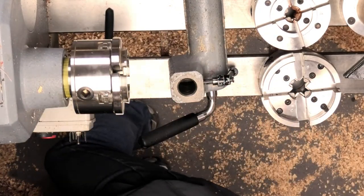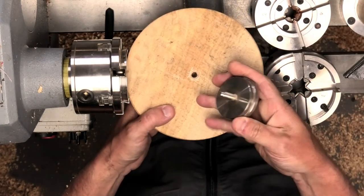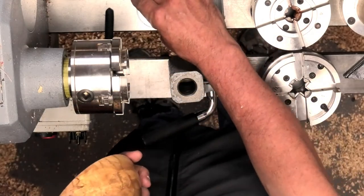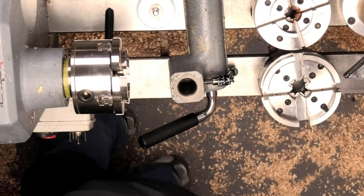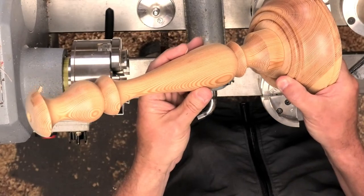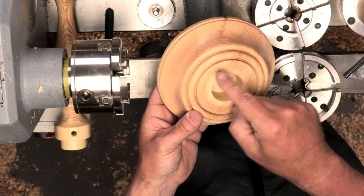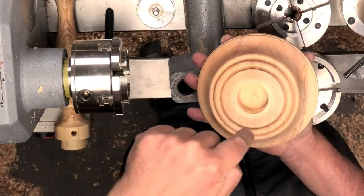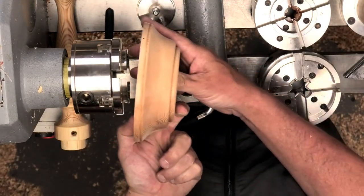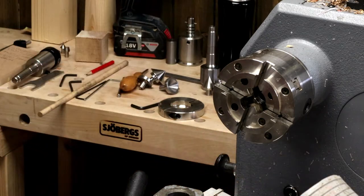If you're making a bowl, anybody new to woodturning has two choices for holding it: either a faceplate, or a center hole using the screw chuck. I tend to use the screw chuck more on smaller pieces. For something like a candle set, if I try and make the base using a faceplate I'm just going to mark the area with screws. So I need a screw chuck with a center hole to screw that on, create the outside and underside with a recess, then flip it around onto my C-jaw dovetail and turn the inside out.